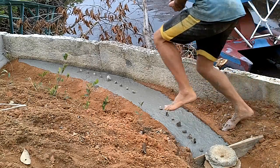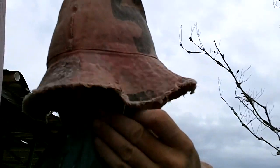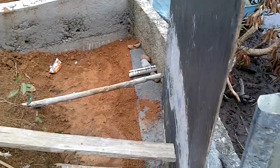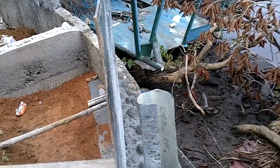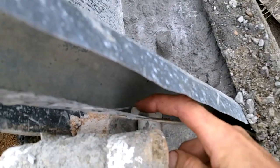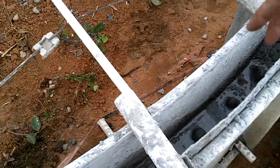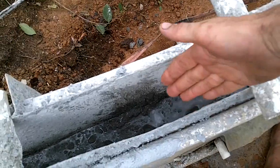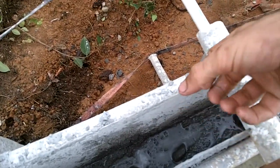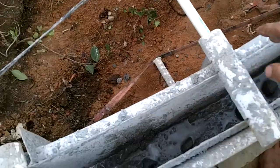In the meantime I can whip out some bulldozer parts. This is a little tricky to get connected in here but not too bad. It's not a perfect curve but close enough. This has some little cutouts that fit on the end of the PVC with the nail going through it that hold this on, and then this is pulled like a bow so it's the right curve. But then this piece had nothing pushing it out, so at the top I put pieces on that hold it open, and at the bottom I stuck a few rocks in that were the right thickness — same thickness as the wall — just to hold it in place, and those just became part of the concrete when I dumped it all in.